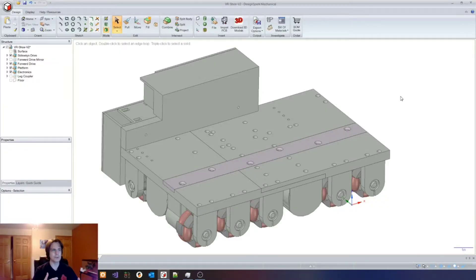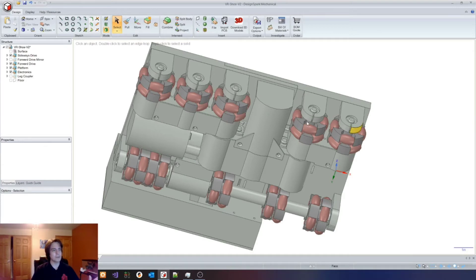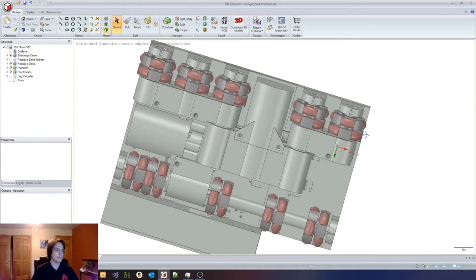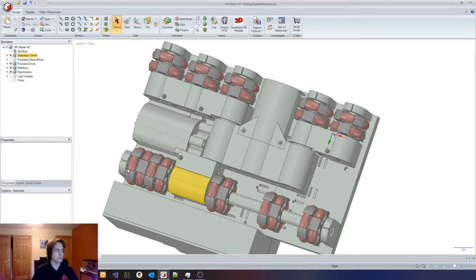By the way, you may have noticed the wheels were a bit loud during testing. If you have any ideas on how to make them quieter, let me know in a comment or join the Discord linked in the description. Now, here is the new layout I came up with. I wanted to distribute the forward and back wheels across the whole length — I was able to do that. The sideways wheels are still distributed along the whole length too. Before there were just three forward and back wheels; now there are five. Side to side also has five. There's one motor that goes to all the wheels, and another motor with a gearbox that rotates a single axle.